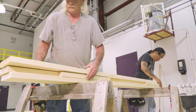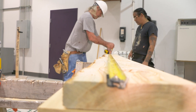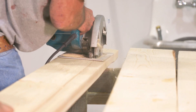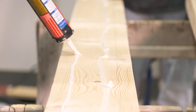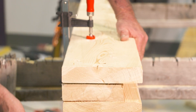None of these 2x8s had their length cut. They must remain 8 feet long so they span the full width of the walls. Only one of the 2x8 boards used to make the ceiling should be rip cut to a width of 5.75 inches. This board will be used as the middle piece to make the groove in the first or starter ceiling beam.